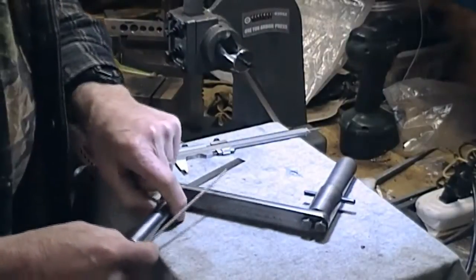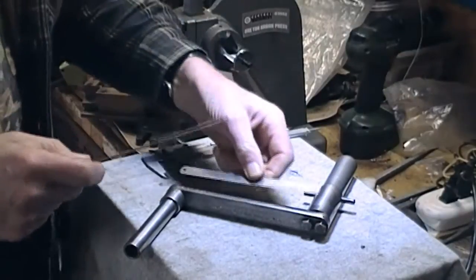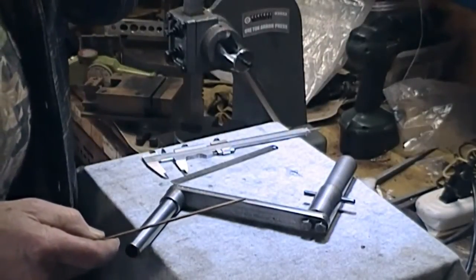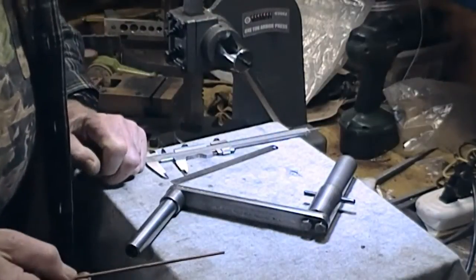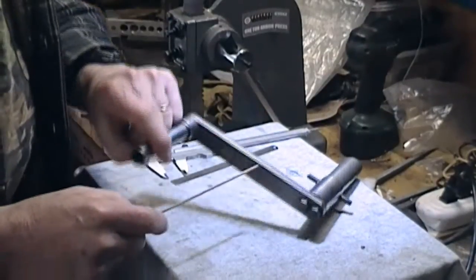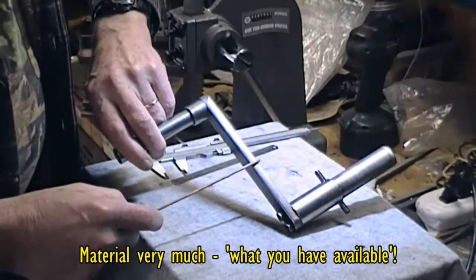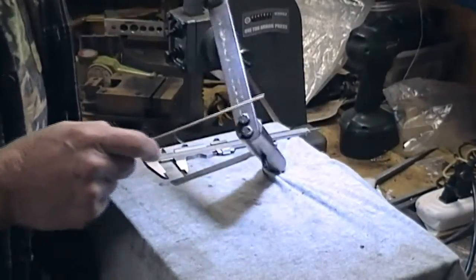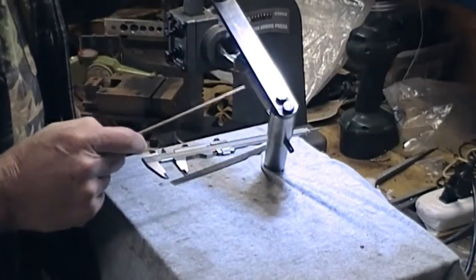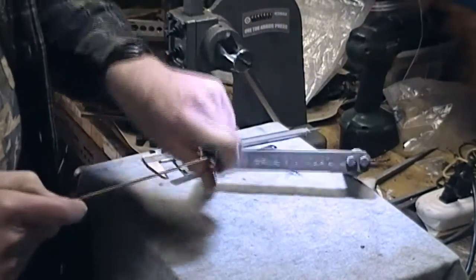The arm section is actually about seven inches — I told somebody it was a foot long but it isn't. That radius gives a 14 inch diameter turn, so you've got quite a lot of leverage there if needed. The material is a piece of inch scrap, three-eighths thick, attached to the spindle insert section by two bolts. One bolt might do, but two is better because then it won't turn.